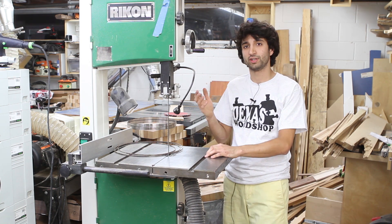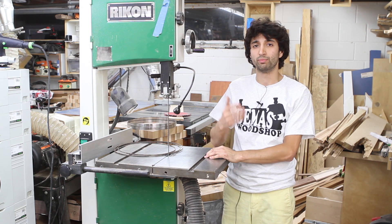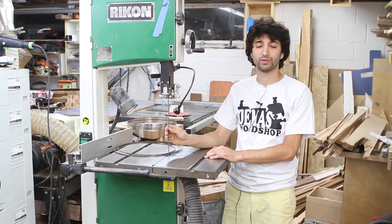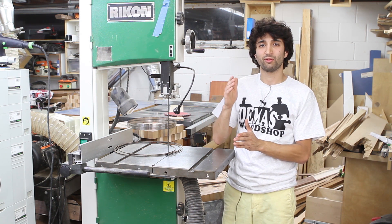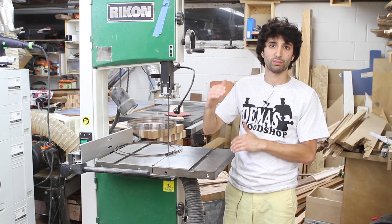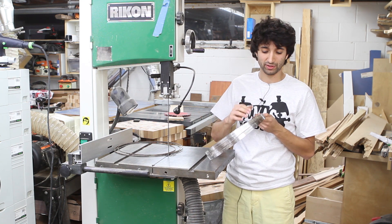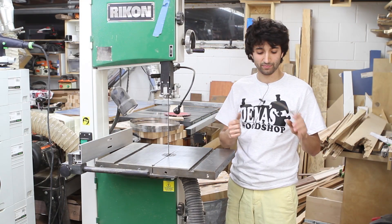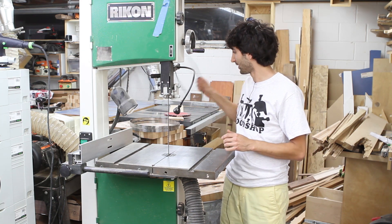The other reason I chose half-inch is versatility. As you can see in many of my videos, I do a lot of resawing and a lot of curve cutting, and the half-inch blade gives me the flexibility to do both operations with one blade. I can't cut really tight radius curves with it, but for the work I do, I always have one side that's pure waste, so I can make relief cuts on that side and work right up to my line for a perfectly curved piece. The other blade I have — a 3/16-inch standard bandsaw blade — I used back when I was in my bandsaw box phase and haven't had it on the saw for a long time.